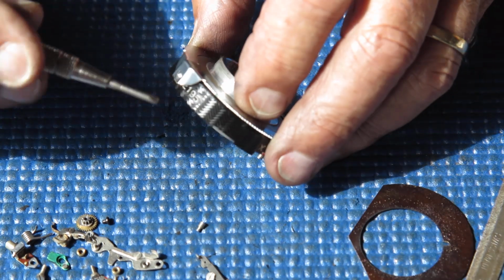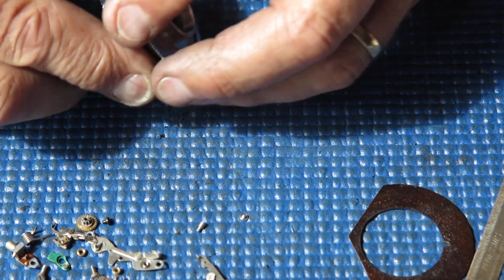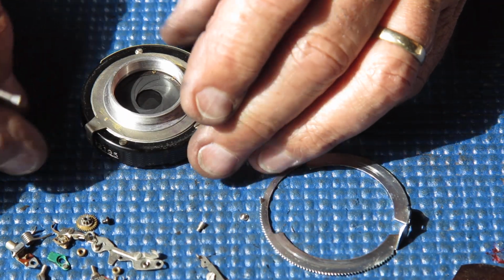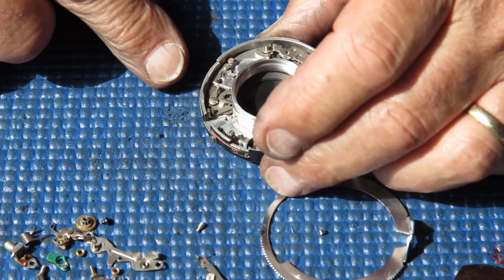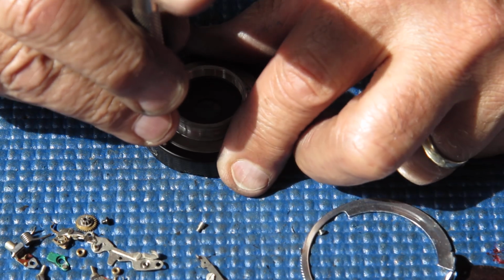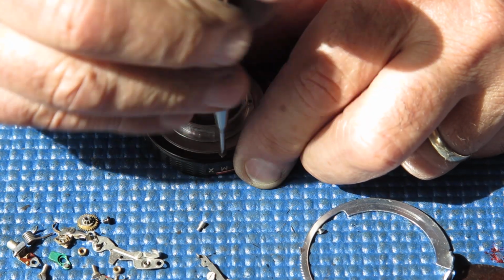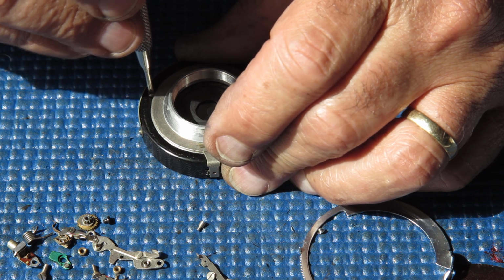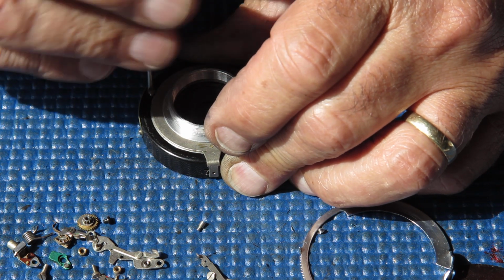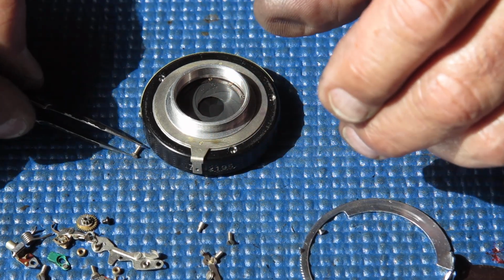Aperture setting here, we have a single screw at this point, holds this chrome lever, that lifts off, and we have the shutter body itself. Nothing unusual looking here. 3 screws at the back hold the shutter case and the mechanism plate together. Those 3 screws are identical.